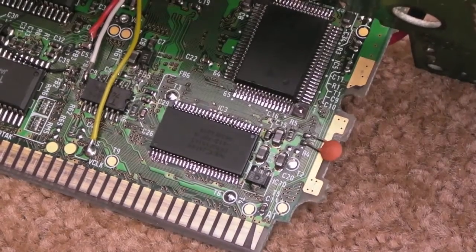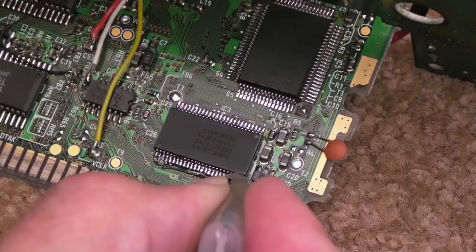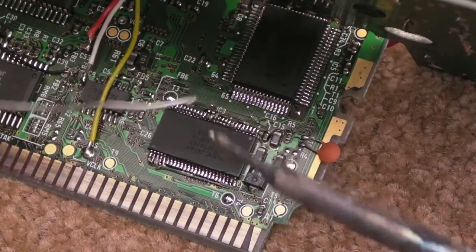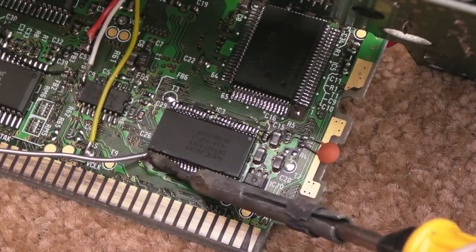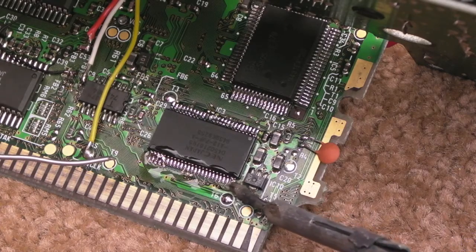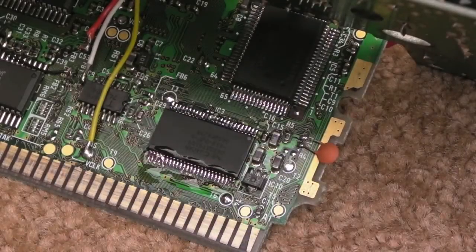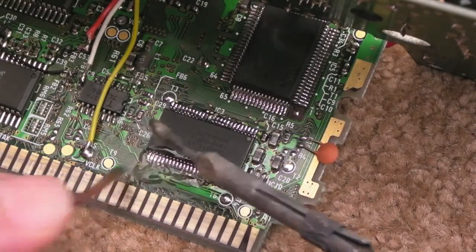So as a final thing, I'm just going to tidy up this chip a little bit. I did remove the flux with isopropanol, but there's just not quite enough solder on there in my opinion - it looks a bit uneven. I'm just going to put a bit more flux on there and add a little bit of solder, go over that just one more time, just to do a slightly more professional job. Now I've got too much solder. The key really with these is not trying to heat the actual pins but the actual pads - if you heat the pads you get a better distribution of solder where it needs to be, rather than just being up the way on the chip.